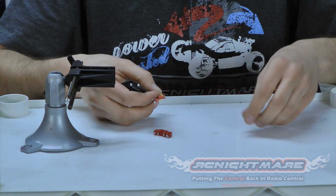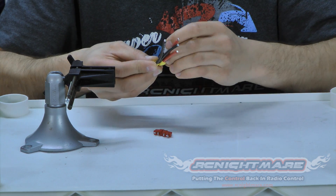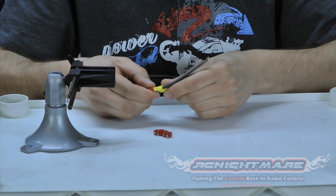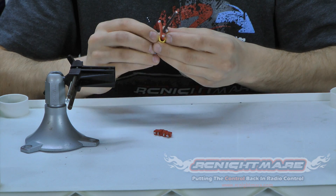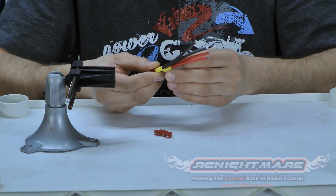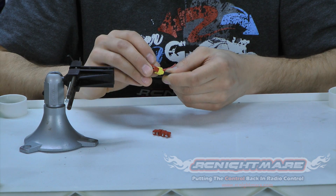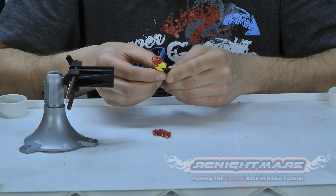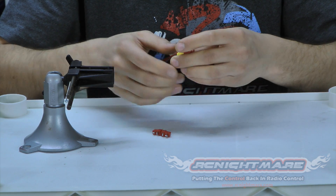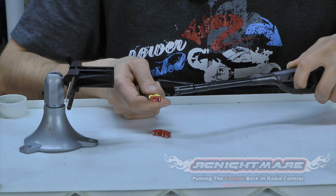Let it cool down a little bit and then put the shrink tubing over. Make sure you cover it all the way. Some guys don't prefer shrink tubing and that's fine — if you don't want to use shrink tubing you can insulate your wires in many different ways. Some guys just use electrical tape, though that's not the best method. I've seen shoe glue used, I've seen silicone used, all types of things. But as long as you've got a really good insulator over the top you'll be okay. I don't mind using shrink tubing — it cleans up nice.